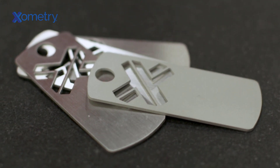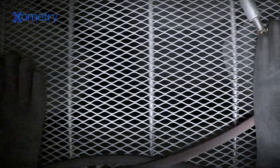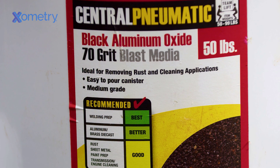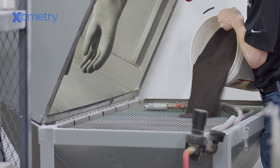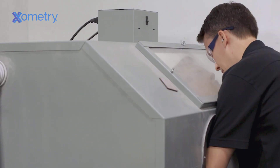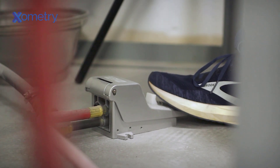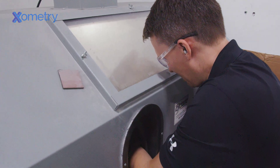Media blasting can be a great way of treating the surface of parts, from removing old paint or rust to giving parts a uniform cosmetic finish. Usually, when we blast parts, we use less aggressive media such as glass bead to give parts a matte finish. For today's test, we'll be using aluminum oxide, an aggressive substance usually meant for tough jobs on hard materials like steel. This will simulate weathering effects that materials may experience over time in harsh environments, but in an accelerated time frame. Each benchy will go through two blasting sessions — once with the blasting nozzle a few inches away to see how they generally resist abrasion, and once with the nozzle very close up to test extreme conditions.